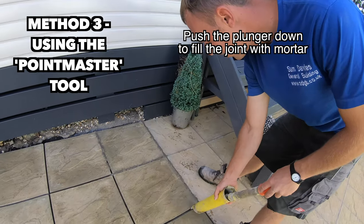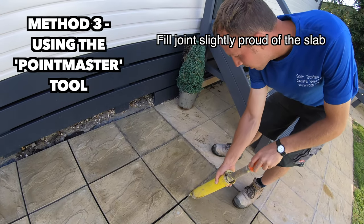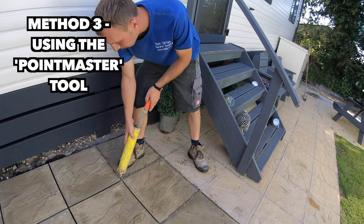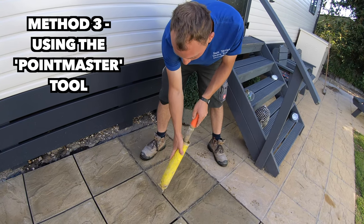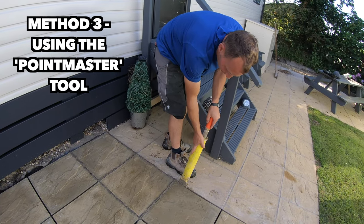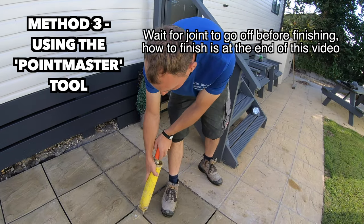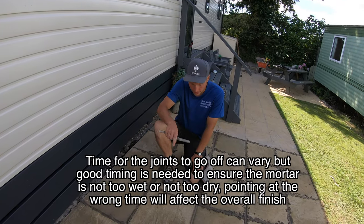It's just light pressure pushing it in. You want to be slightly proud on the slab — it doesn't matter too much if it is on the slab because once it's dry you'll be surprised how little staining there will be, as long as you don't try and rub it off when it's wet. You can always go over your patio with a bit of cleaner a few days later if you do make a mess. Once you're used to this gun it's very quick and easy to use, but you've got to make sure you keep it clean.